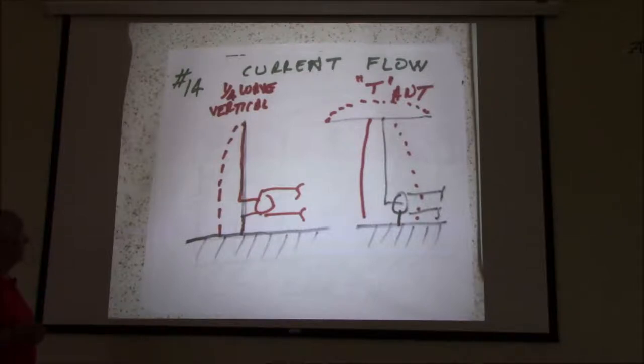So unless you do something, you get an impedance mismatch to 50 ohms. It's 35 over 50, right? But actually, I figured out how to get around that, and I just detune the antenna a little bit and get 15 ohms of reactance, like capacitive reactance, and the antenna can't tell the difference. The transmission line can't tell the difference. Now I have an impedance of 50 ohms. I get my 1-to-1 SWR.